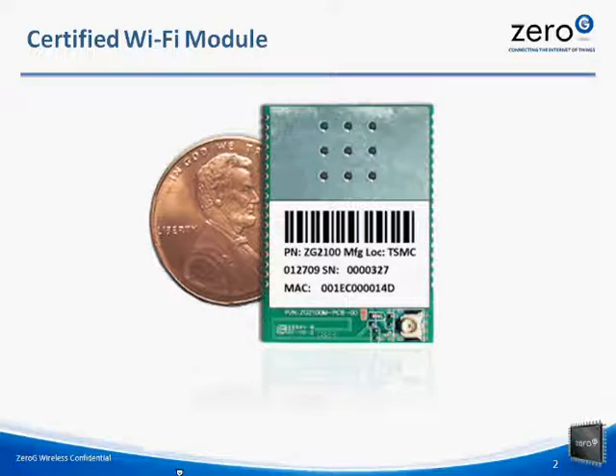Zero-G makes it easy for you to build a Wi-Fi application. We offer 14 different antenna configurations, which include an onboard PCB antenna and 13 external antennas, covering various antenna gains, radiation patterns, and range. Having such a wide set of certifications reduces uncertainty and delay in the certification process because most systems generally need several attempts to pass. We also have test reports containing data that characterize our Wi-Fi modules, and you can use these test reports in areas where you need additional certification. The cost savings from designing with certified modules is substantial and can save you anywhere from $40,000 to $100,000.